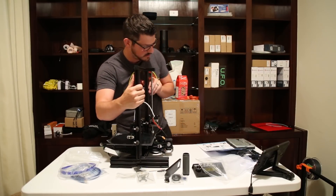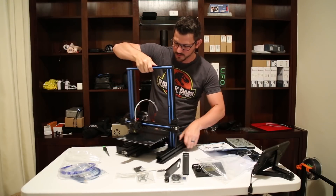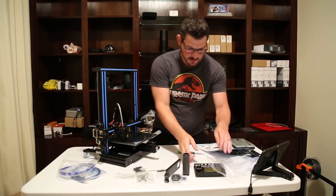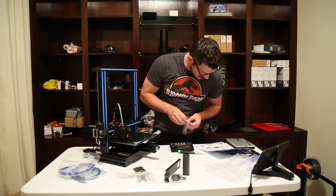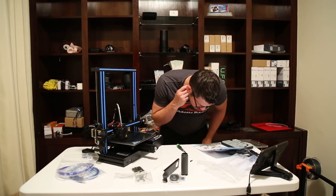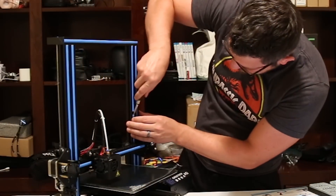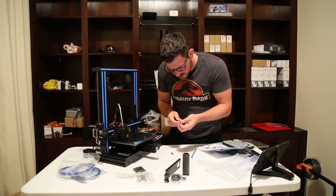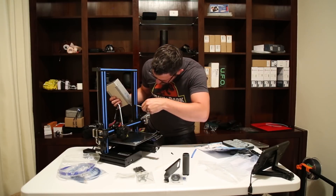Going back to the directions, the front plate of this 4040 has nothing on it because that is where the front panel connects, using 10 millimeter screws for these two button heads. Now we can do the power supply — they have the T-slot strip pre-cut in there. We find the two holes we need, match it to the power supply, and it goes right into the holes in the power supply, which makes it super easy.